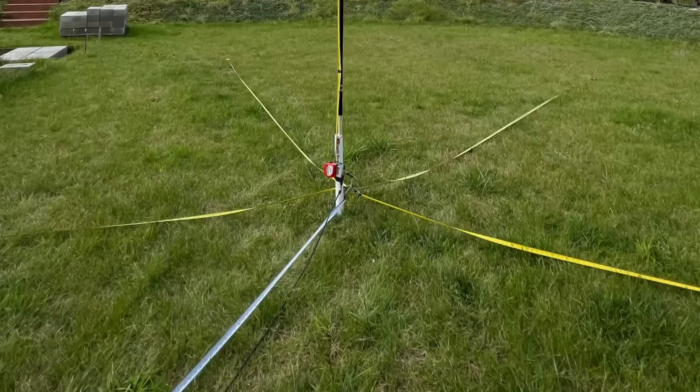I've built a ton of antennas. I was over in Poland working — had a backyard for almost two years and was never near saltwater. I built a few verticals out there and would just do four, five, maybe six if I had an extra piece of wire. Spread it out on the ground — I was probably 15 to 20 miles from the Baltic, which isn't as salty as the Atlantic. I got great results from it.